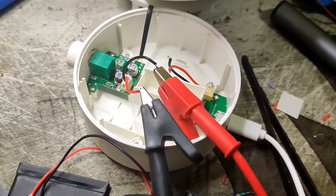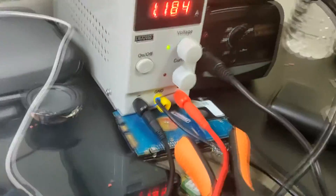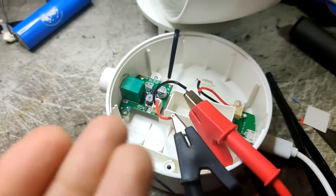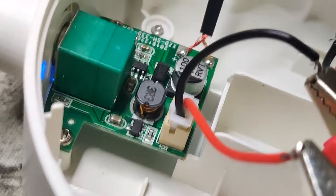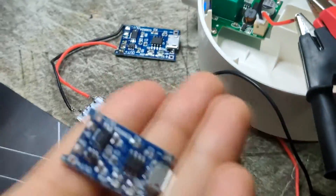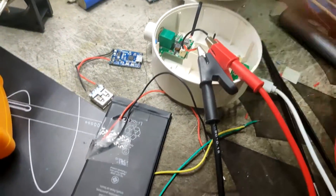I figured out a problem — the design is really weird. On my power supply it's negative-negative, positive-positive, but on this board the polarity is flipped. I didn't plug it in wrong; the connectors align correctly but the polarity is reversed. Smart Devil needs to fix this for DIYers. Sadly I fried one of my boards, but it's only a dollar so I'll redo all the soldering work.